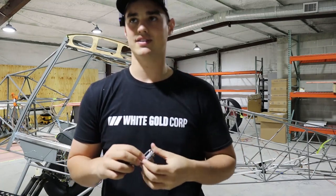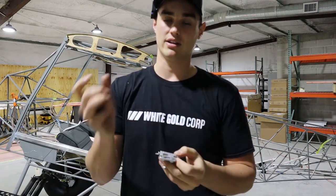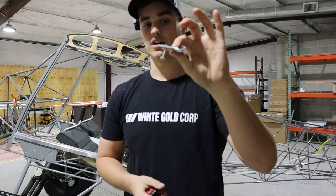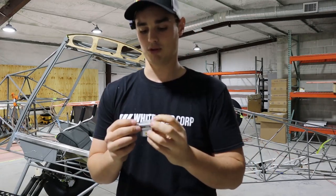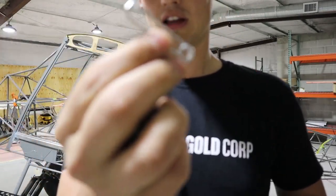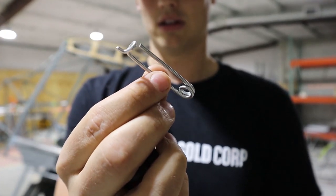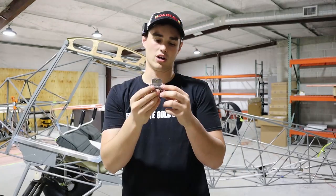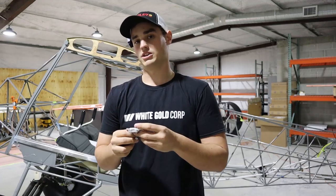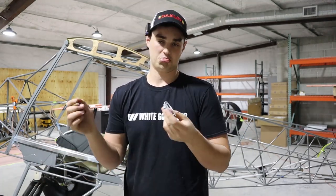The normal rod that's in the hinge is stainless, really tough and hard to cut, so it's best to pull it out and cut it to length afterward. I'm totally skipping that rod design and instead designing custom removable cotter-pin style hinges so the doors will be removable. My uncle is building me these safety-pin style door hinges that will be strong enough to hold the door in normal flight, with a cotter pin safety feature, and easy to pop out so I can fly with the doors off — which sounds pretty fun.